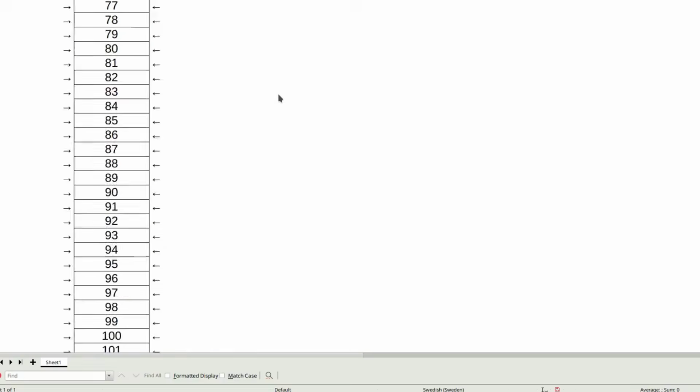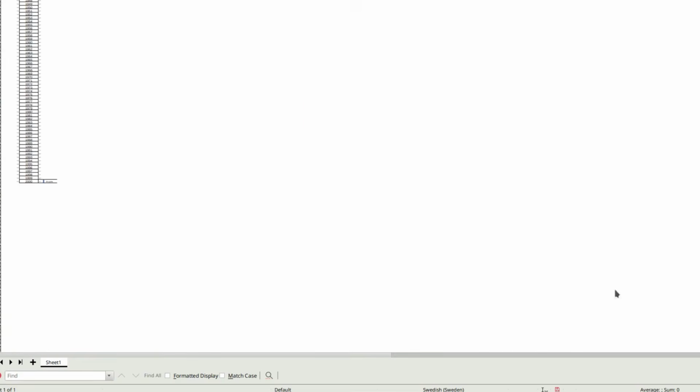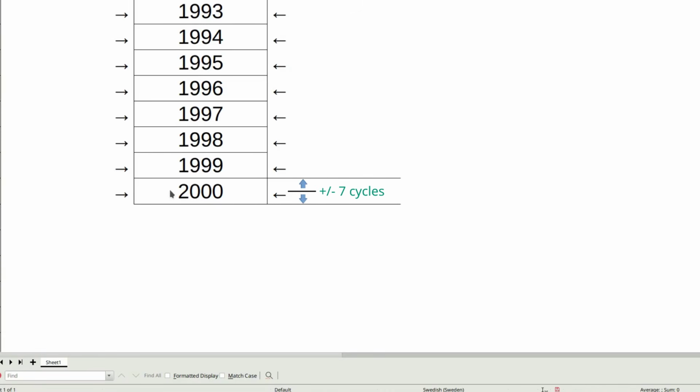This is perhaps a corny illustration, but the assembly program read operation must align up with the address generator for all the characters in memory. So read access number 2000 cannot differ more than ±7 cycles. With a modern computer such as the Pi, this would be impossible since the execution time jitters much more than this. However, the old and trusted PET executes at a very constant speed because the architecture is dead simple, so we just need to adjust the speed to match.